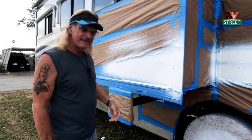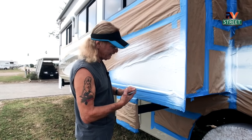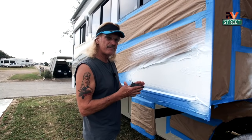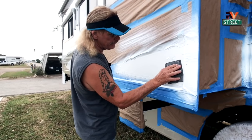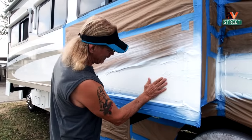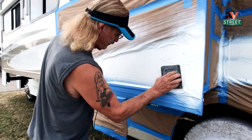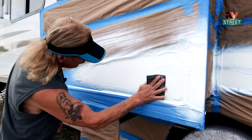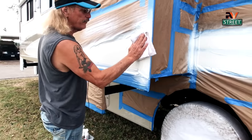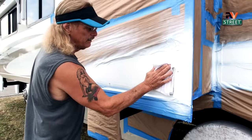It's day two, 9:15 in the morning. You can see this white base coat really, really came out nice. Now I'm going to take this 400 sandpaper — very fine — and just gently take off that fresh paint roughness. When you spray a surface and it dries, it's just slightly rough, and I'm trying to take that little roughness off very lightly. Look at those cracks — they all filled in almost 100%, I'd say about 90%. I'm really happy with that. After sanding with the 400, take a damp cloth and wipe off all that dust.